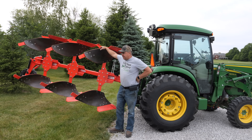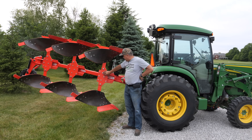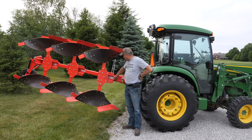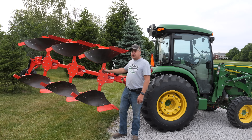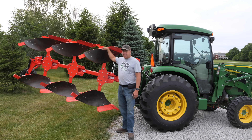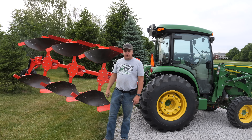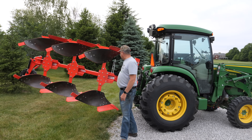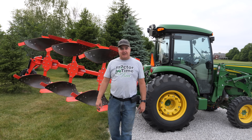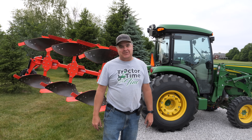I'm more determined than this — I'm not going to give up this easily. I see a couple of things I might be able to do. This plow is quite adjustable. I'm not sure, but if I could move all of these bottoms forward to the front holes, maybe that would shift enough weight closer to the tractor that I could lift it. Of course, I'll have to lift it with dirt on it too. There's also another choice: I can take off the third bottom and run with only two. I'll tell you a lot more about this plow next episode. Thanks for watching everybody — we'll see you next time on Tractor Time with Tim.